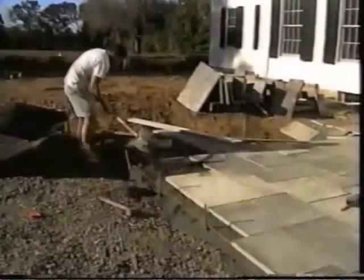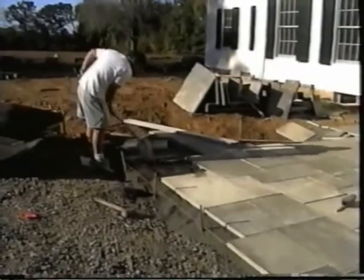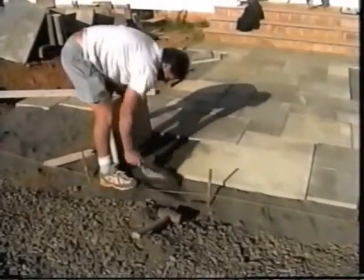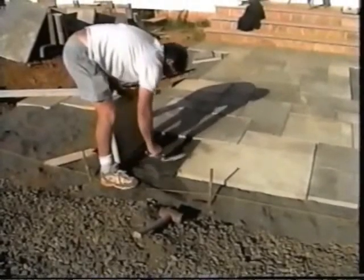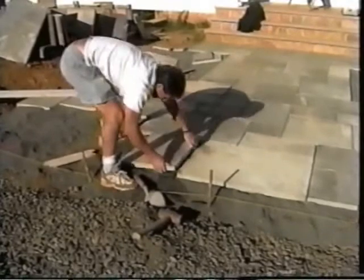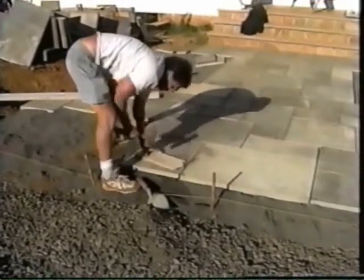Because of frost or buried pipes and cables, many customers prefer their patio stones to be laid without the use of cement. The mason lays a base of gravel and then a small layer of stone dust. Leveling out the stone dust to a determined height, he pre-lays his stone, and using a piece of wooden hammer, seats his stone to the proper height.